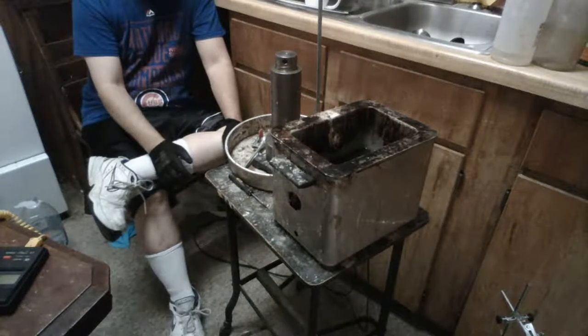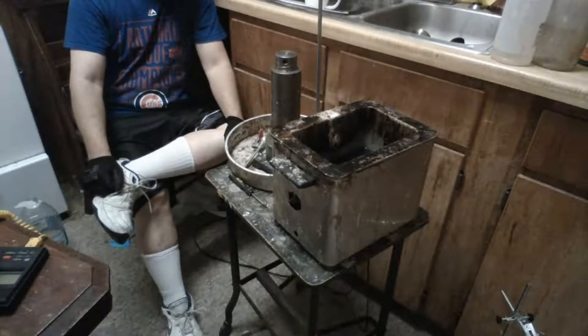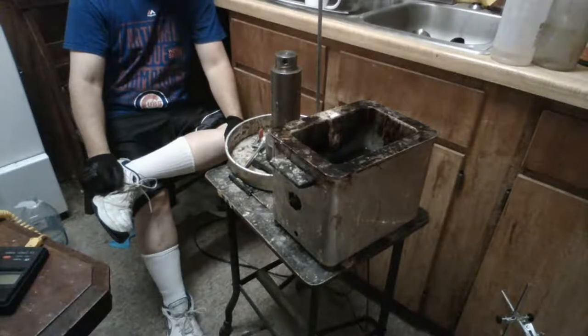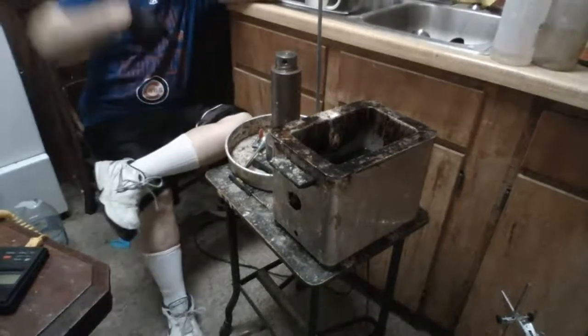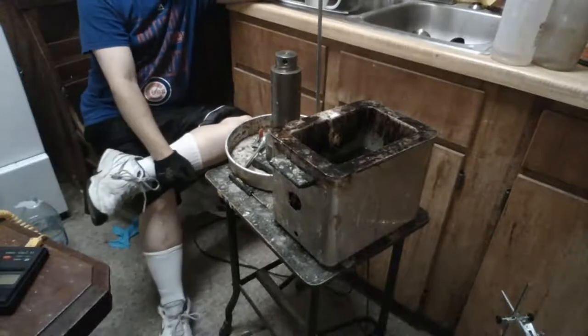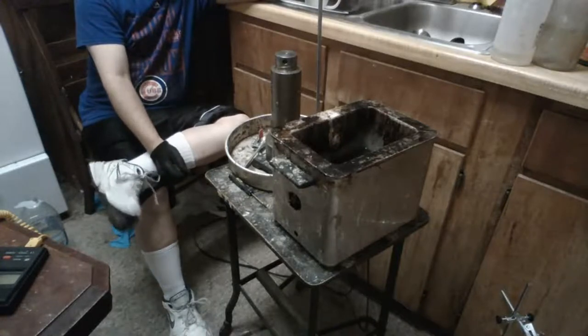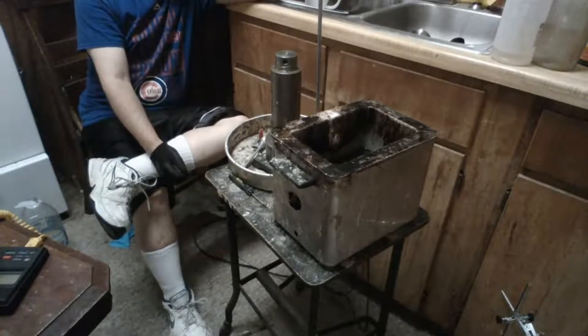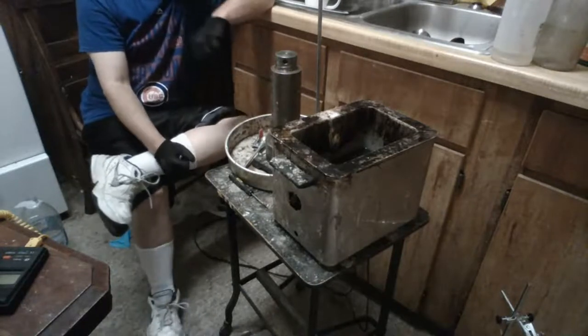And also, another bad problem with the smoothbore mold is you have to kind of distort the middle of the record to get it out. It can also put stress on it where it'll actually fracture the middle of the blank. Not this way, but there'll be a concentric ring in the record because we pulled it somehow, taking out the smoothbore. So there's a lot of disadvantage to smoothbore molds. There are a lot of technical reasons why there is a spiral core.